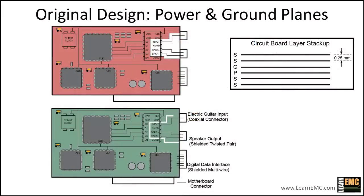Here's the design of the power and ground planes for the board. The power plane, shown by the red fill, extends over the whole board except for the area below the analog traces. The ground plane also extends over the whole board, but a gap in the ground plane isolates the area under the analog traces from the digital part of the board. Notice that the gap does not extend all the way to the edge of the board at the upper right, so the analog and digital sections of the ground fill are joined at that point.